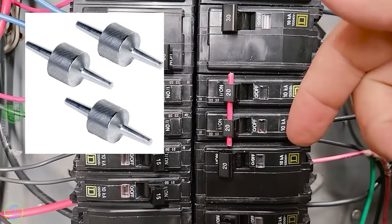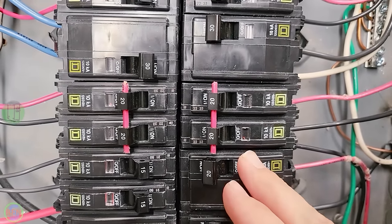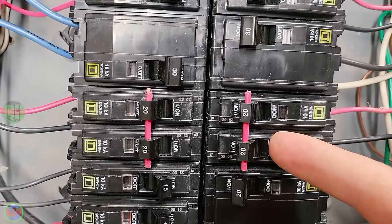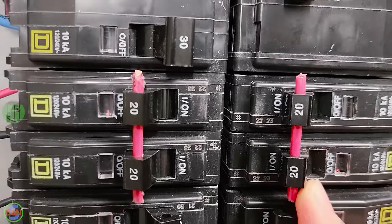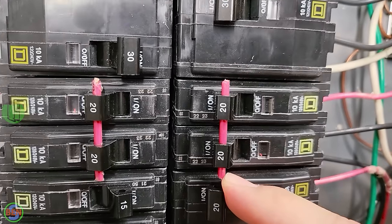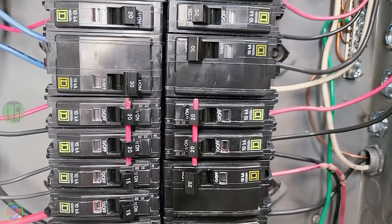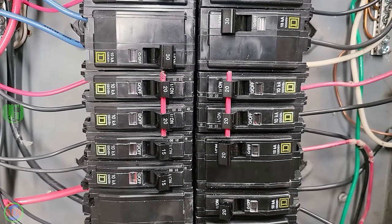And I will link to the correct handle ties in the description of this video, so you guys can pick those up. We actually might order some handle ties that are designed for these particular breakers, but as a stopgap between now and when we have those, you can use a piece of 12 gauge THHN, which is basically just a little chunk of scrap 12 gauge wire, and it fits perfectly through the handles and gives you a clear indicator that, hey, these are multi-wire branch circuits, and you want to be able to disconnect them simultaneously. It's easy to identify them really quickly when you look in this panel.